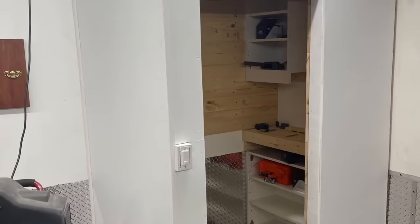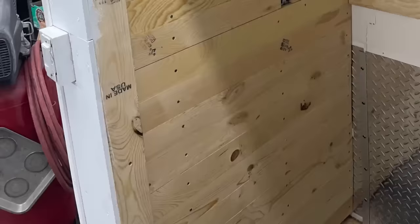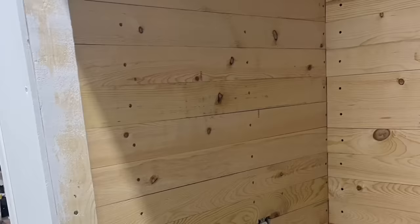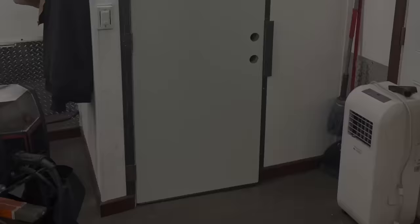Now that all the painting is done and the room is framed in, it's time to go ahead and finish the interior. I basically finished it with slab wood — 1x4s. I went to the lumber yard, I picked up the straightest 1x4s I could, and I screwed them to the wall. I did that because now anything I want to hang on the wall, I don't have to look for a stud — I can just screw it directly to the wall. So everywhere that had white inside the room basically got these 1x4s screwed to it, and you will see at the end that I was very easily able to hang firearms and whatever else to inside of the vault.